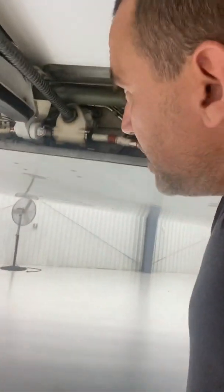I've seen nuts and bolts, cotter pins, metal debris, and rags in there. Another thing I've seen after aircraft cleaning — if you left the flaps down, the cleaning company will clean the actuator screw perfectly shiny, and they'll say 'your airplane looks great.' Well, they just took all the grease out, and that's a big problem. That grease is very expensive; you'll have to get it overnighted. Make sure there's grease on your actuator screw.